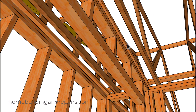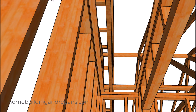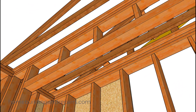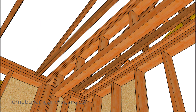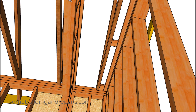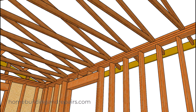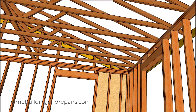Next up, let's head over to the other side. Of course the drywall backing here — a 2x6 over a 2x4 wall is only going to give you a 1-inch exposure, but a 2x6 seems to work pretty good over 2x4 walls, just as long as it's actually centered over the wall. Because if it isn't centered, you might have an inch and a half on one side and a half inch on the other side.